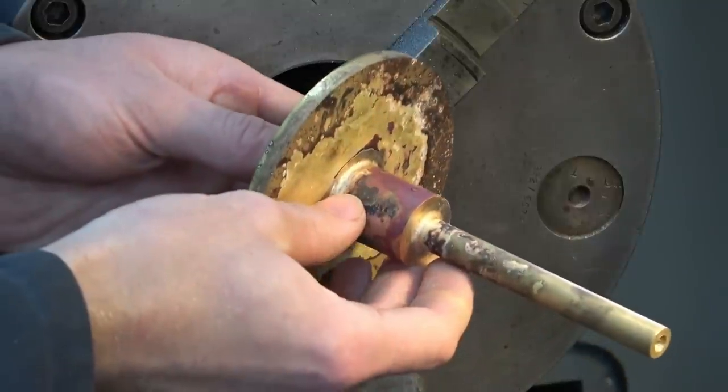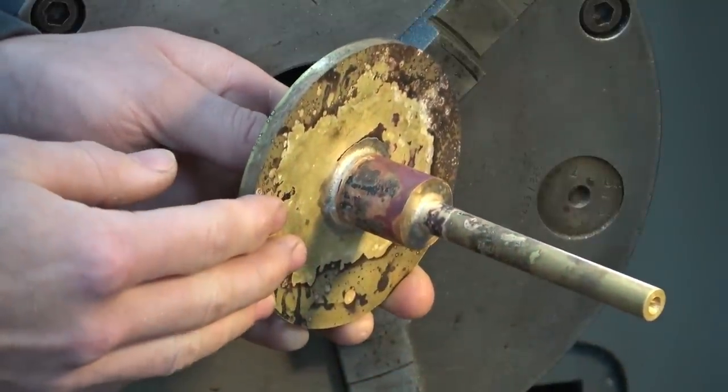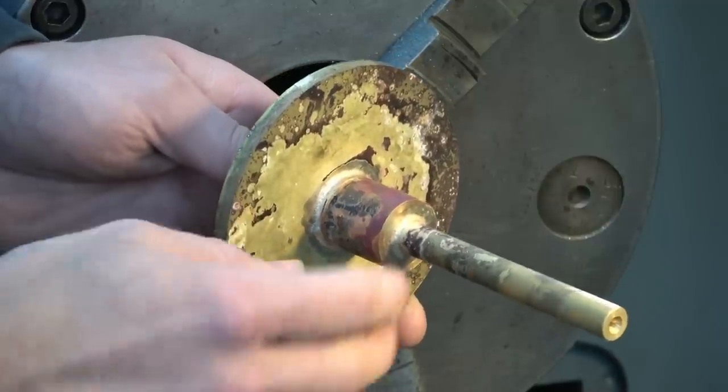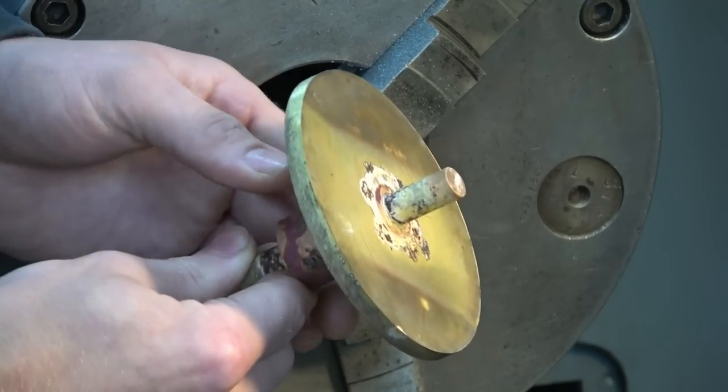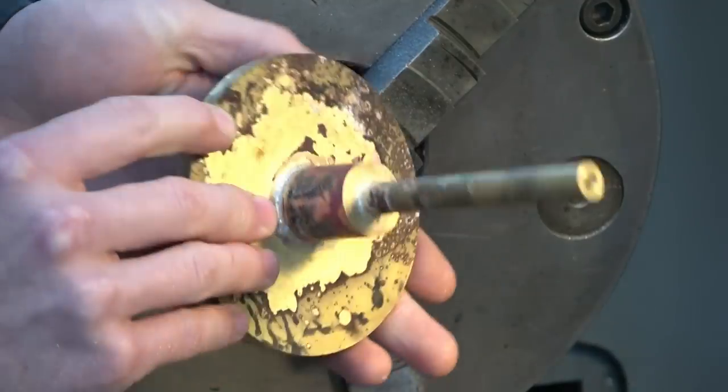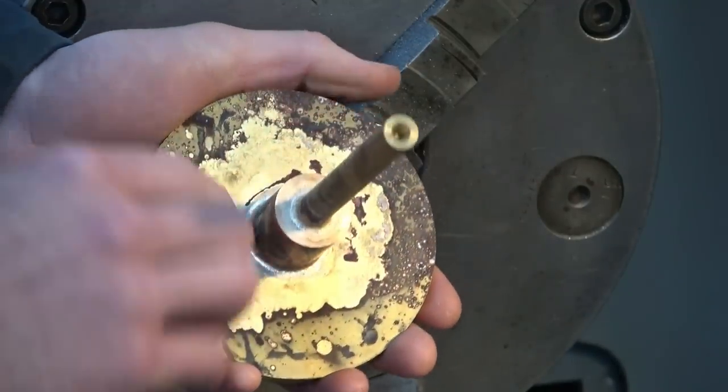That was, by the way, general purpose, easy flow silver solder, about 40% silver and a melting point of 650 degrees Celsius. That happens to be an old batch that still has cadmium in it, which is now banned. It's poisonous, but it helps it to flow well.